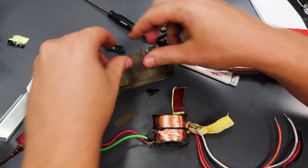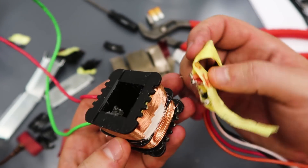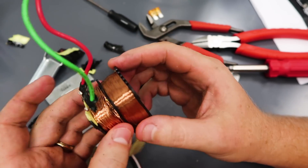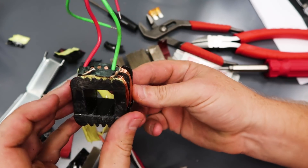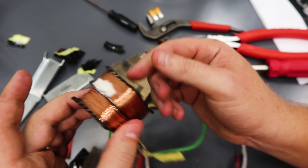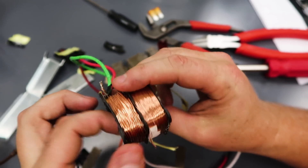The primary windings all came disconnected because of how thin the wire is — they just pulled right out of the solder or broke off. It's just wraps of wire around a plastic core. The layer of plastic acting as an insulator to the core does reduce efficiency a little bit, but in manufacturing these are easier to spool. If you counted the wraps, you'd have 10 times more on the primary side and 10 times fewer on the secondary, with the secondary staying connected because the wires are much bigger.